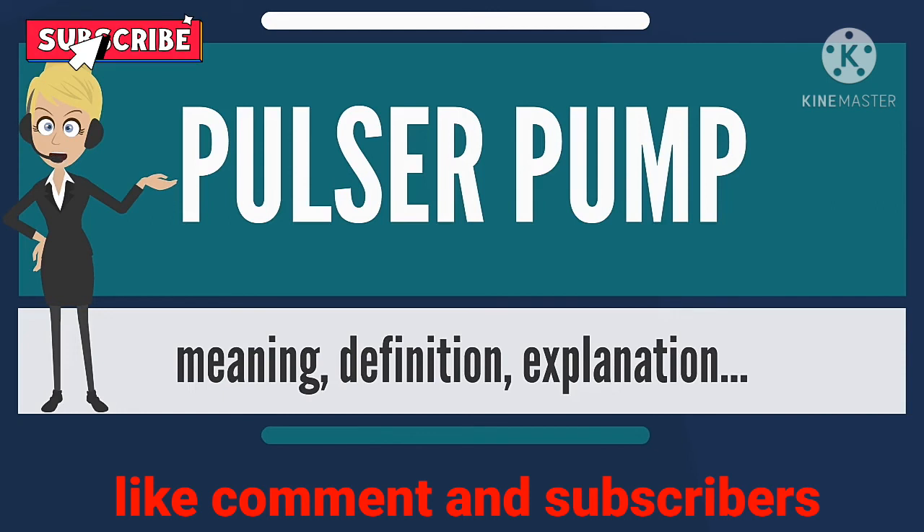Brian White, a stonemason by profession, claims to have invented the pulsar pump in 1987 and put the idea in the public domain. However, Charles H. Taylor invented the hydraulic air compressor before the year 1910 while living in Montreal. The working principle of the hydraulic air compressor and the pulsar pump is exactly the same, but the purpose of the compressor is to generate compressed air, expelling the water up to 30 meters high to prevent potentially damaging over pressure. The primary purpose of the pulsar pump is to use the air pressure to expel the water to a higher elevation.